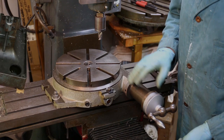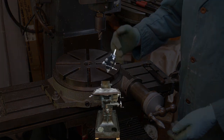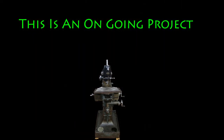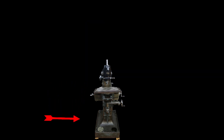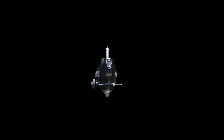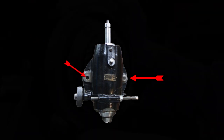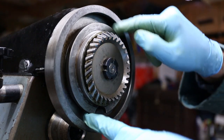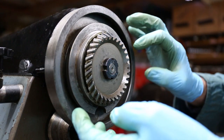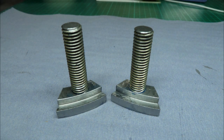The job that's intertwined with this rotary table started in my last video. Let's have a little recap of the T-nut job part one. One of my ongoing projects is the rebuild of this wonderful miller machine, called the Alexander Master Toolmaker. This piece at the top is a vertical head. It should be held in place by two bolts but one is missing. Behind the vertical head is a T-slot that is circular, which allows the head securing bolts to slide in the slot and secure the vertical head at the required angle. The single remaining bolt is going to be replaced along with the missing bolt by two curved T-nuts. It's the manufacture of these two T-nuts that requires the use of this rotary table.